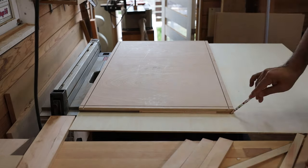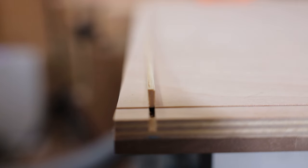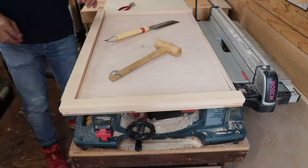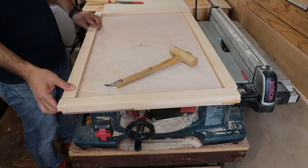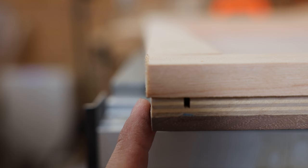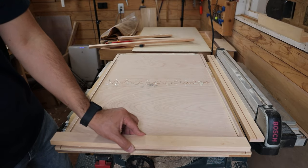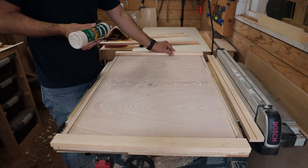Making a little bit bigger bottom panel with quarter-inch plywood. The tabletop has a sandwich structure. The main purpose is reducing weight. Making a sandwich with Titebond. I hope it straightens the bend in the top layer a little bit.